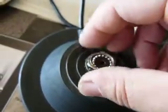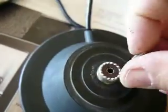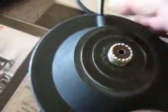What you're going to want to do is start out by unscrewing the nut and the star washer on the SO239. Next, take a knife and cut that center piece of plastic out to expose the back of the 9/16 nut.